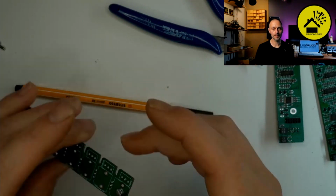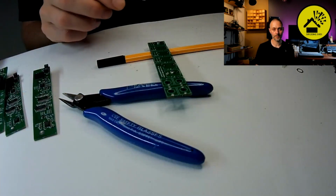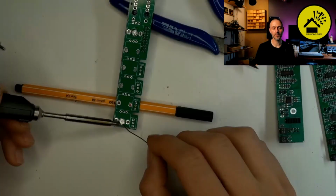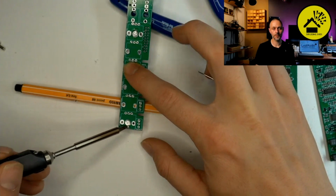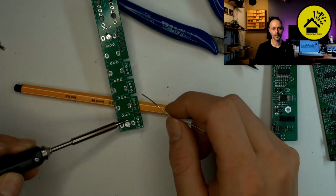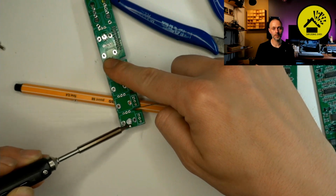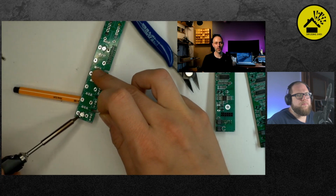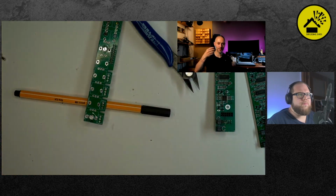The soldering stations in the lower price range have what you call passive tips, indirect tips. So the temperature sensor and the heating element are actually located rather far away from the tip. Because of that, you get a temperature gradient from the heating element towards the tip. To compensate for this, you need to set the iron higher than your intended soldering temperature. So with these passive tips, 350 or 380 degrees for leaded solder is not that uncommon or crazy, actually. Also the super cheap irons have the hottest point not at the tip directly, but a bit behind it. Then there are always these bubbles.